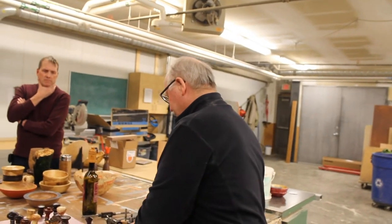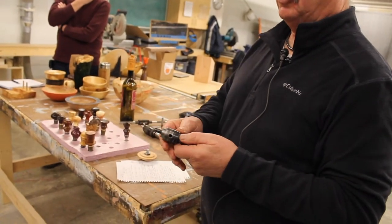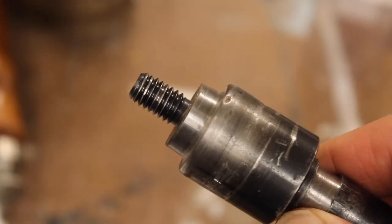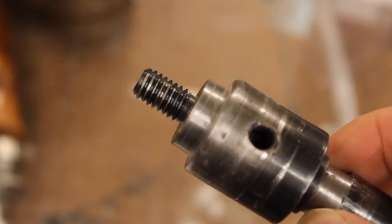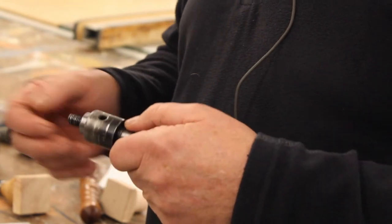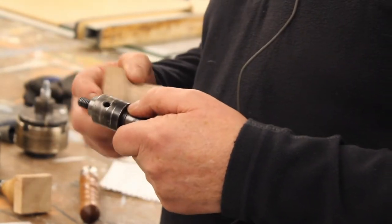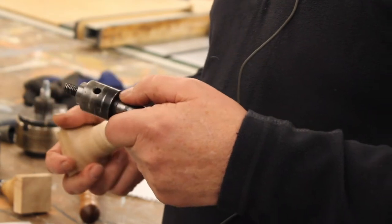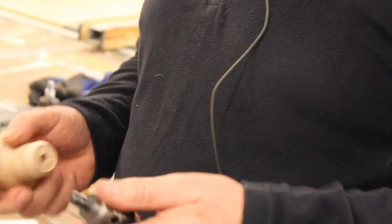I got rid of that and purchased a mandrel — it's a little handier. It's got a slot in here that you can use to create threads in your wood. Just twist it on and it gives you good threads, but twist it on and then twist it off a couple of times while you're doing it, so the wood isn't jamming up the threads. Get it tightened right down and then take it off once or twice just to clear all the wood and debris out of there. Otherwise you might get a buildup, or if you get it too tight you'll have a hard time getting it off the mandrel later.